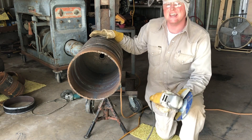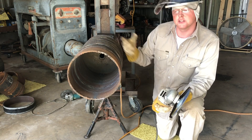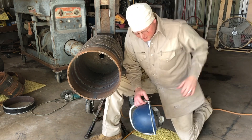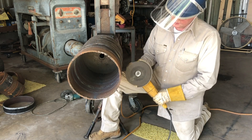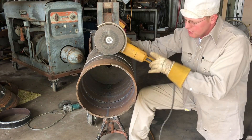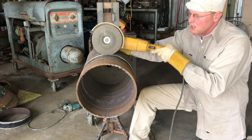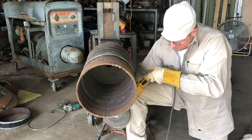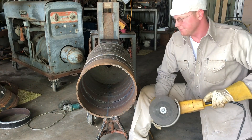The most important thing is to stay inside the bevel. Something to remember: if you are partnered up with somebody on bigger pipe, one helper starts on top, one helper starts on bottom — that just keeps each other out of each other's way. In a good scenario where you don't have to lay down, you can get on one knee like this. This will help you stabilize yourself. Keep in mind — like I said — long strokes. You might do little strokes just to get the starts down real good or get the high spots down. Try to work on cocking the grinder this way. I try to keep the handle of this grinder close to the pipe at all times — that will keep your grinder from jumping, running a lot smoother, not getting a bind. Go as far as you can, and once you can't, flip it around and keep the handle close to the pipe on the bottom, because if you get too far out it's gonna want to come up. So keep the handle of the grinder close to the pipe all the way around and that'll help with it jumping.